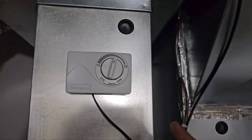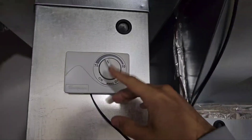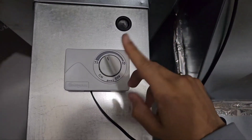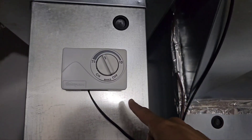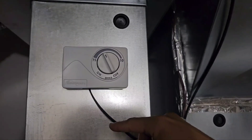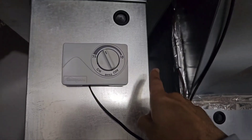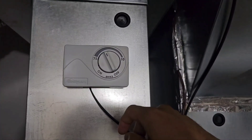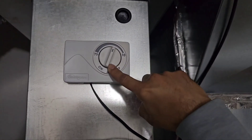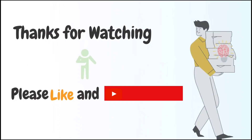One quick tip: if you have your humidity stat set to 45 and your dehumidifier upstairs set to 35, they will compete with each other — the humidifier will try to add moisture as soon as the dehumidifier reduces it below 45. You have to make sure that whatever setting you put on your dehumidifier, you also match it on your humidity stat, so they aren't fighting each other.